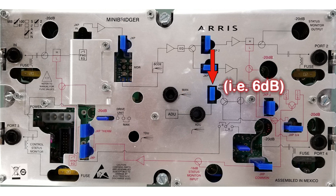Make sure you have the manufacturer recommended ADU pad in place while setting the ADU pot. Now that the ADU pot is set correctly, place the ADU jumper into the manual position so that you can set up the amplifier before switching to AGC mode.